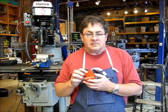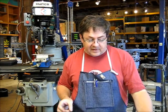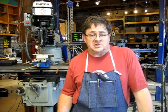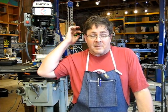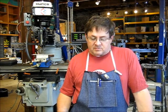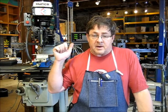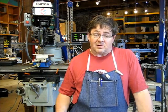The only thing to watch for when you're using these cutters, this ValCut setup, especially when you're cutting stainless, is it cuts a continuous chip. It does not break a chip. If you're using like power feed to feed your ValCut setup, it's going to make a continuous chip, and it's a limb remover, right? If you can break your cut by working with your feed to break the chip, you'll be a lot better off.